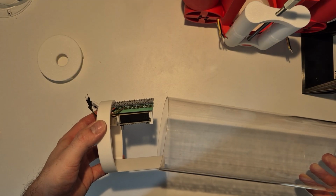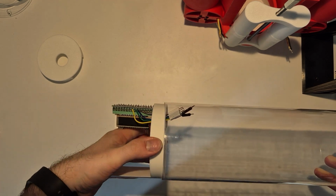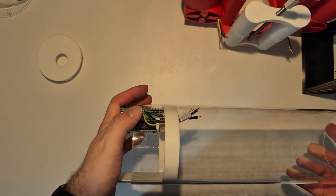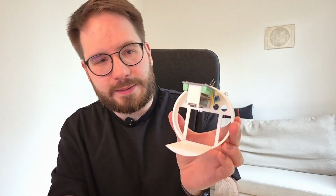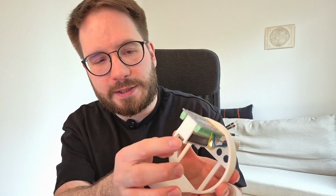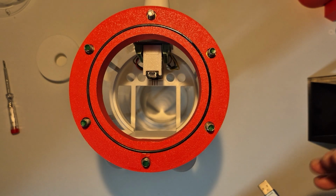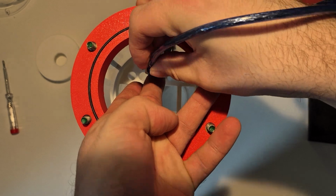And you can probably guess that since this is circular, this goes well inside this thing in the front, just behind the dome. That's the reason why the Arduino is positioned like this: when you remove the dome, you have quick access to the Arduino's micro USB connector, so you can just plug a cable in, while the submarine is field stripped, basically, and reprogram it if necessary.